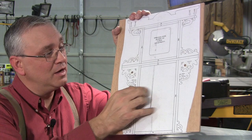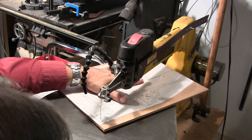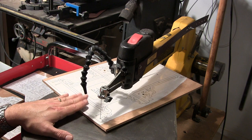The next thing I'm going to do is go ahead and cut out this back wall, this outer perimeter. I've got a few inside cuts to do on it, but once I get that done I'll have an entire page of plans cut out and ready to go. A big piece like this — having a 20 inch throat from the blade to the back comes in really handy. With this DeWalt you'd be hard pressed to do this on a smaller scroll saw, because it's just so big. You could do it, but you would have to use a spiral blade and shift the work left, right, forward, backwards.